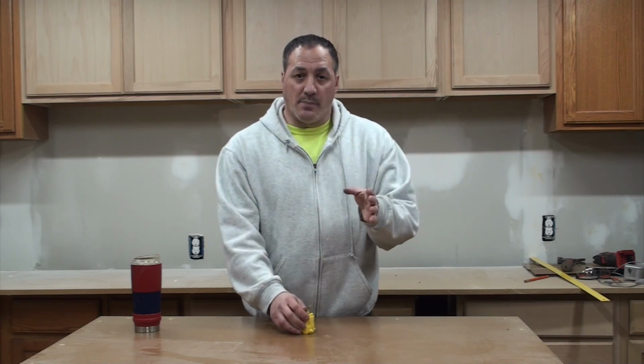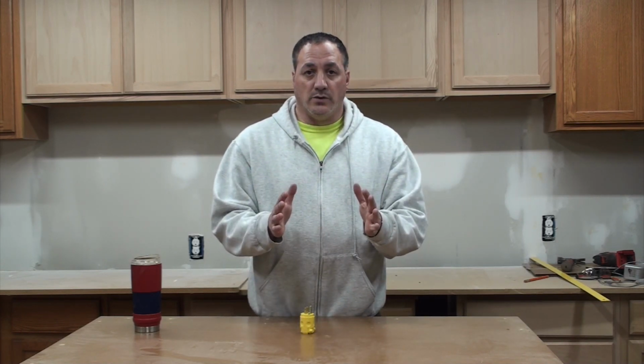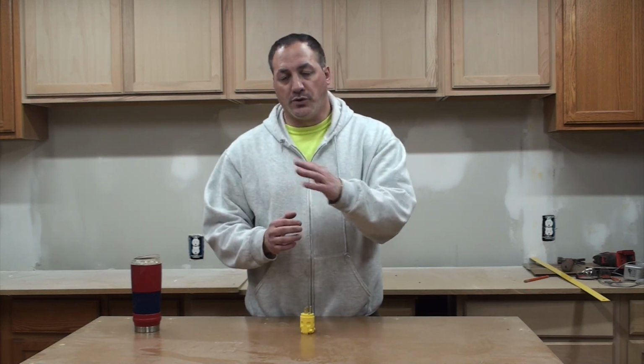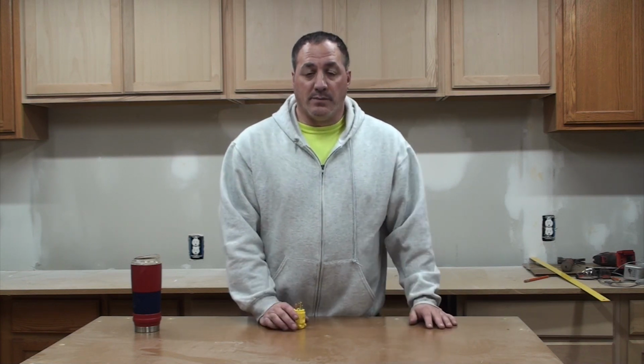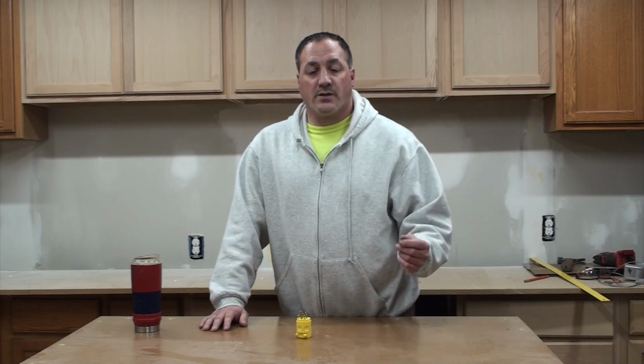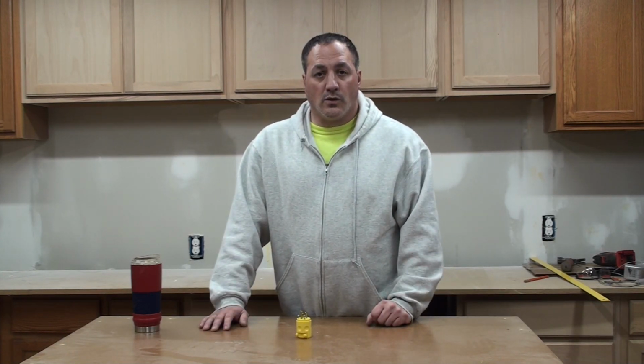And then after that, we have to go to the motor of the table saw, so we have to have access to that, look at the panel, and on the panel it will tell you either 110, 120 / 220 or 240. If it says that, then that simply means you are going to be able to change that voltage. So let's get started.